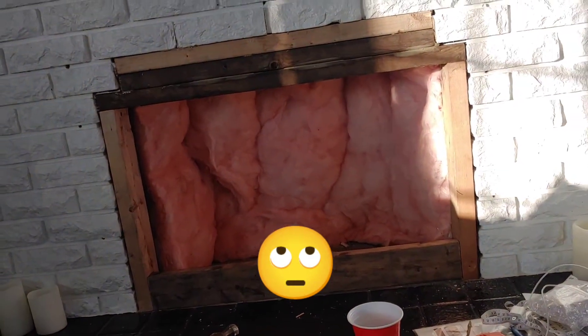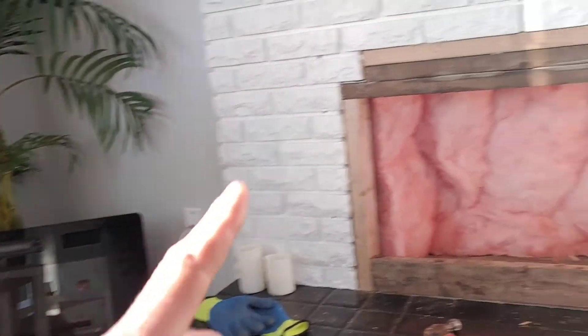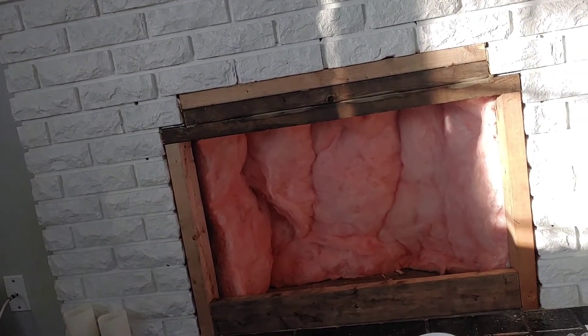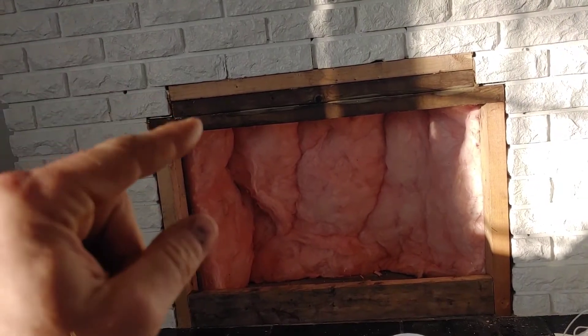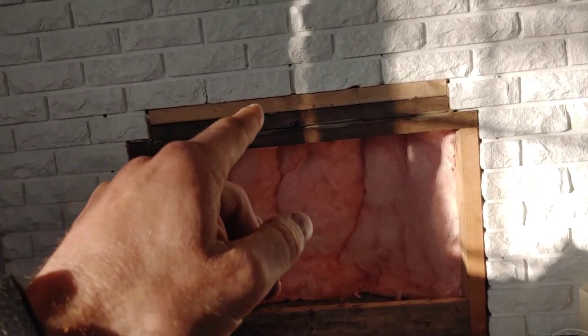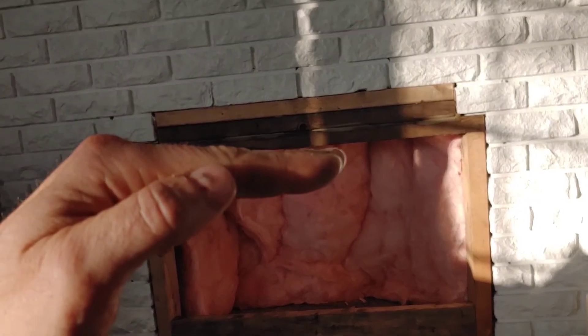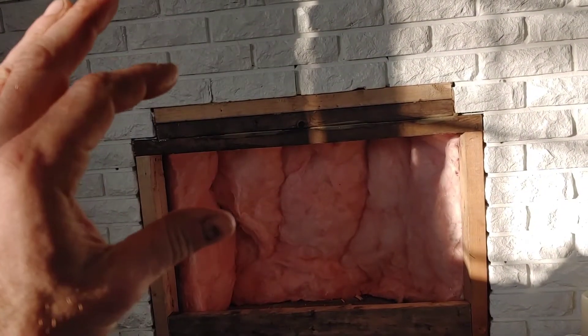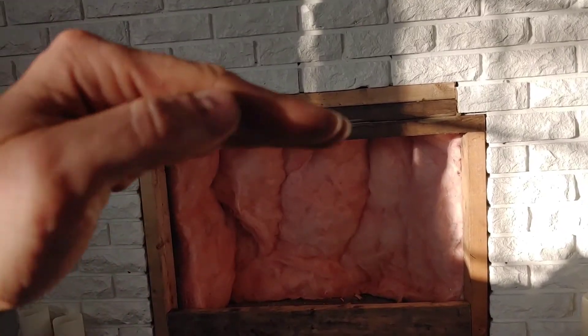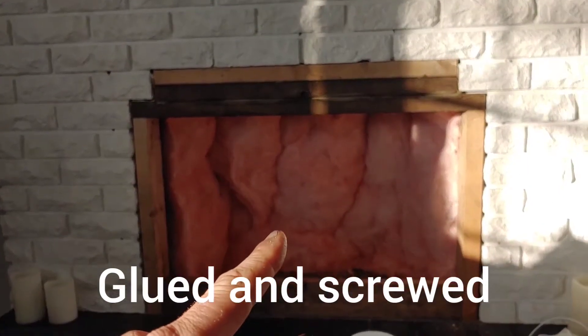My rough opening looks good. I haven't figured out exactly how I'm going to mount it yet, but once I get it in we'll probably have to come back and do a little bit of trim all around to camouflage all this jaggedness. We had to repair the lintel that was cut — the bricks were sagging — so I've got this jacked back up into place in a kind of sandwich arrangement. It's not perfect, but it'll hold everything up. It's glued, and this should work just fine.